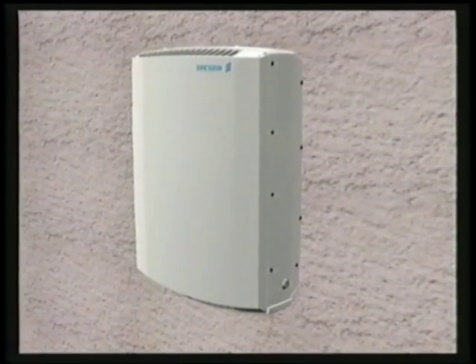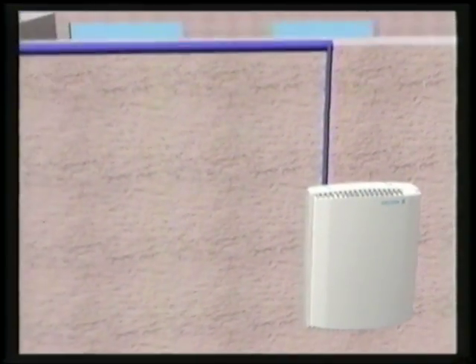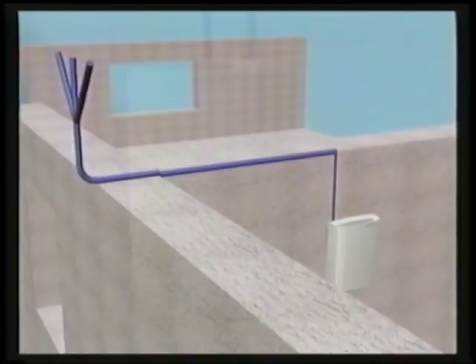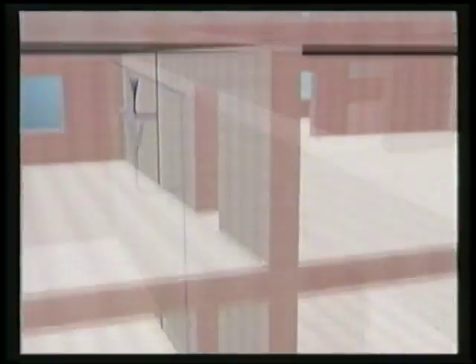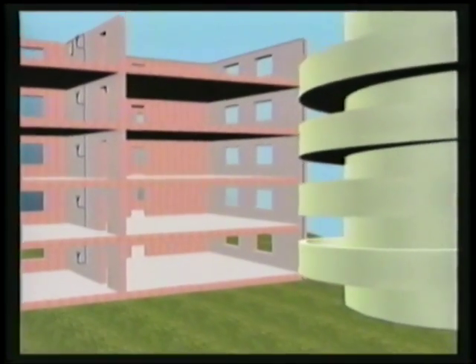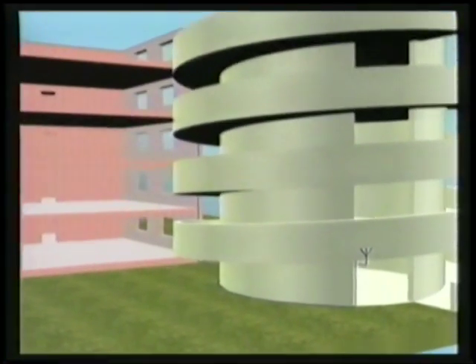The RBS 2301 has four different antenna solutions. External antennas: the antennas are mounted on exterior walls or on roofs. Multi-casting box: extending from the box are two coax cables going to different parts of the building. The one on the right covers the various floors of the building and the one on the left covers the garage and outside front of the building.